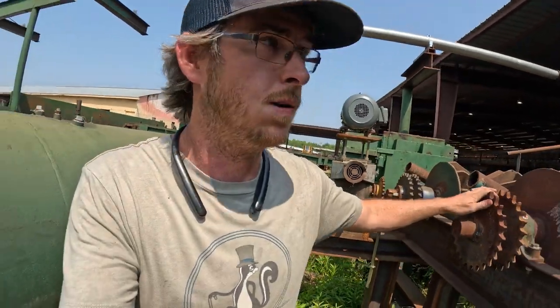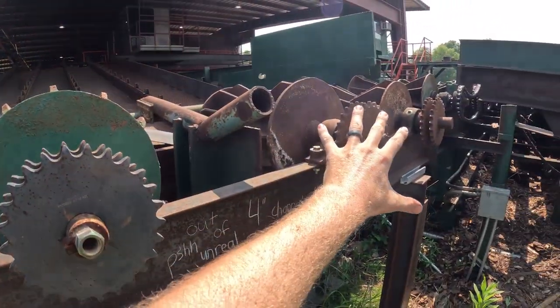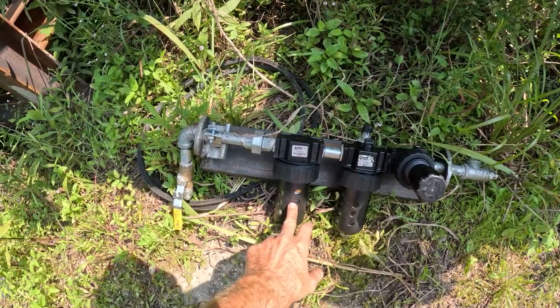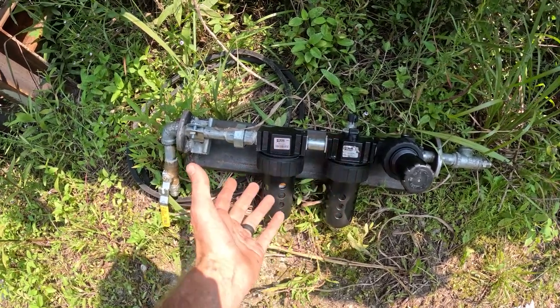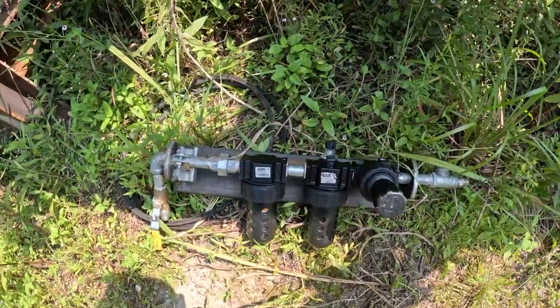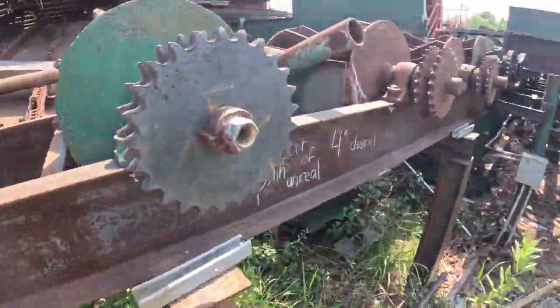This thing isn't quite in place yet, but it's more or less going to double our production. I'm finishing getting these hourglass rollers in place. Got our air assembly here — got a water separator, which just takes the water out of the air. It's got a water separator and it goes to an oiler, which helps keep your valves and cylinders oiled up and keeps condensation from messing up the bores of the cylinders.